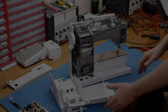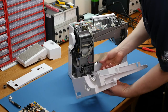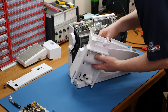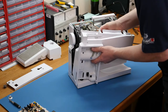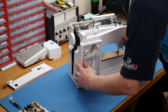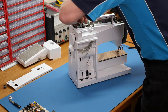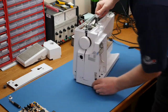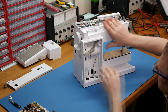Now to replace the back panel and push the four connector wires through the correct holes. The motor wire goes at the bottom hole and the three ribbon cables go at the top right. Feel the case back on being gentle. Be careful with the ribbon cables because they are quite fragile - they are normally a solid core conductor, so if you bend them backwards and forwards too many times there is a risk you may snap the wire inside.